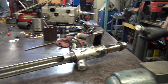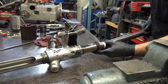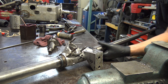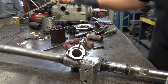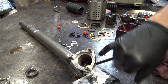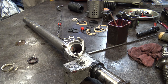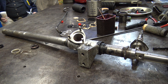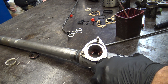I usually use wheel bearing grease or chassis grease — put a little lube on there. Then work that lip in there. Typically here's where you can run into problems, especially on that later rack. Where this lip seal goes into this tube, there's an edge. You've got to make sure it doesn't catch that lip and fold it back or cut it. That's pretty important. This one just slid right in — I watched it and it slid right in.